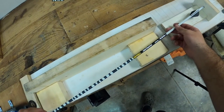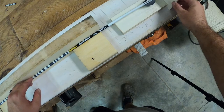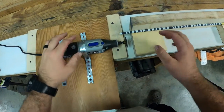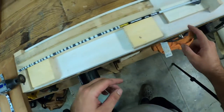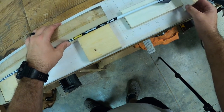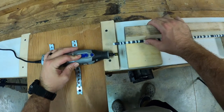All right, I just cut off all my excess. Let's go back into the hole on the back side, bring us to 29 — right there. Now you can see I cut all that excess off and I'm able to slide the Dremel for a clean cut. Let's recheck our measurement — right here at 29, good. Square up the arrow — arrow squared up, cutting wheel squared up, let's go ahead and make a cut.